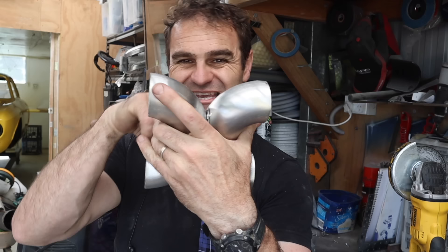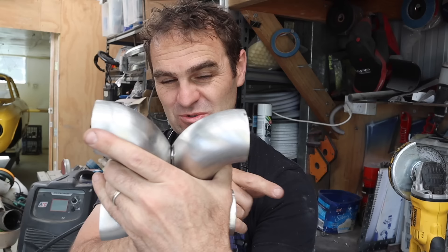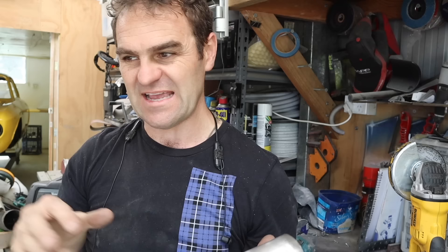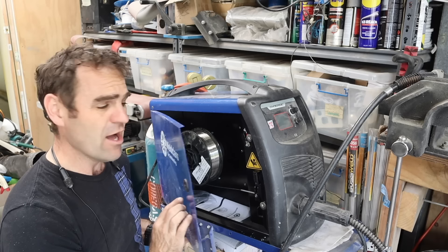I started with a full stainless steel donut that I've cut in half, then cut a shape out of either side so they sit together nicely to make my crossover tube. Having the two exhausts joined like this helps scavenge the other side — the engine runs a pulse from one cylinder then another, and they alternate, each pulse helping draw through the other side. I'm mainly doing this because I need to get the mufflers as close together as possible due to limited space.